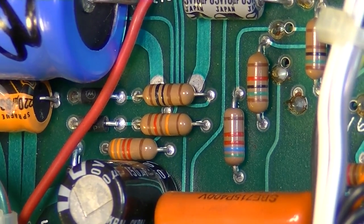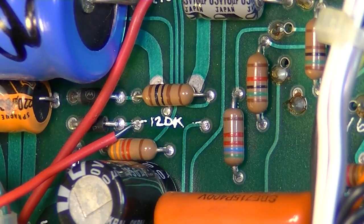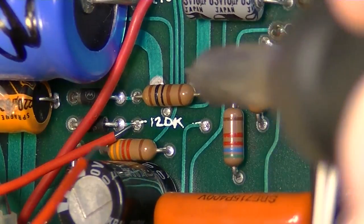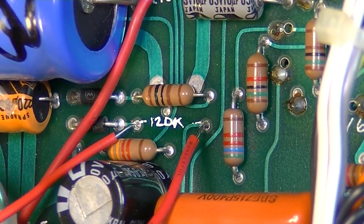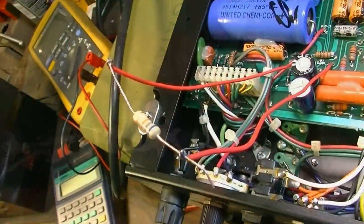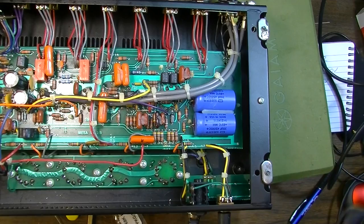Same thing. I want to come in here with a couple of wires. First, we got to remove these leads. I've already got a 2... Well, I might not go quite that low. We'll change it to like a... I think we may just cut it in half at first and see what that does to our voltage. So I don't know. We'll go like a maybe a 50K, something like that. Okay, so there's a 68K soldered into that spot.